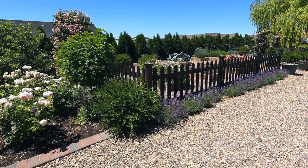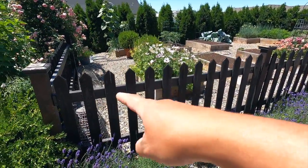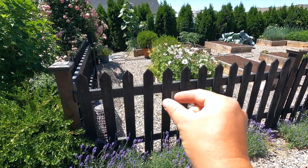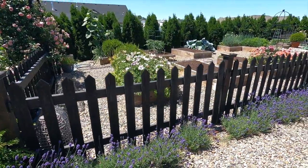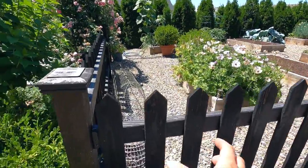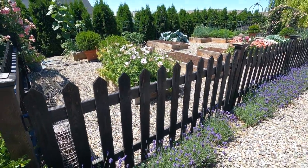With the fence, since this is temporary and I may use it somewhere else later, I want to keep it on the very inexpensive side. I still want it to look nice because we have the Hartley going in and I want it to blend in with our property. I think I can make that happen with pallets. I think I can mirror it after our vegetable garden fence and have it still look pretty good. That fence is just stained wood, so I can cut pallets apart, cut the little angles on top. The slats might not all be exactly the same - some thicker, some thinner - but I think we can arrange them in a really pleasing way. These are three and a quarter inch and so is the spacing on the veggie fence.